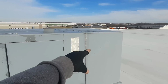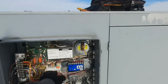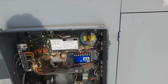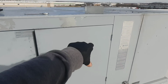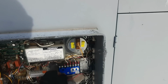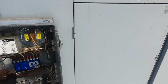Get you a shot. You're looking at the end of that flame. Back here looks like a decent blue flame. It's just overfired, or was overfired, because this is trying to maintain 160 degrees. I think I heard it. Yeah. So that burner's still lit right now, and it modulated when I backed this off. I don't know if you all can hear that, but you can hear the burner modulate when you hit that.